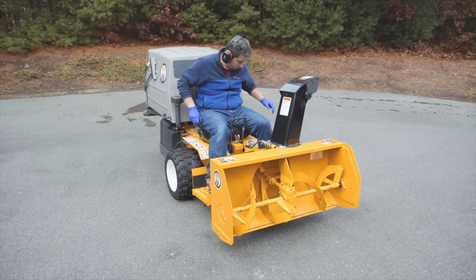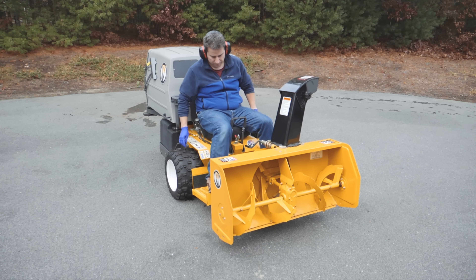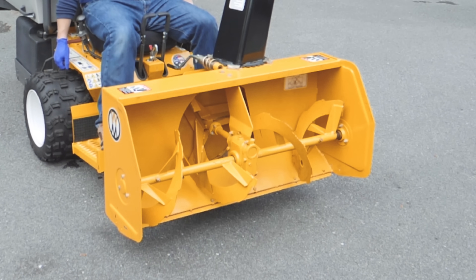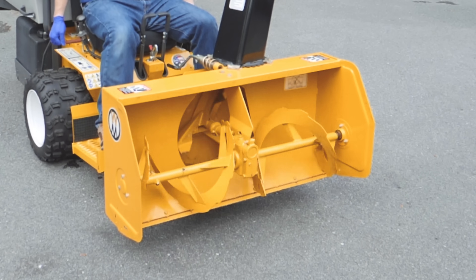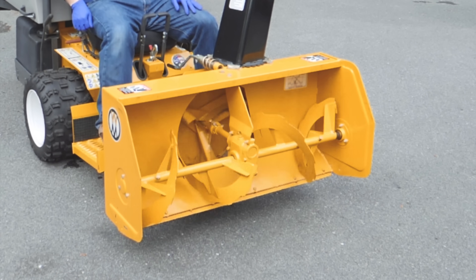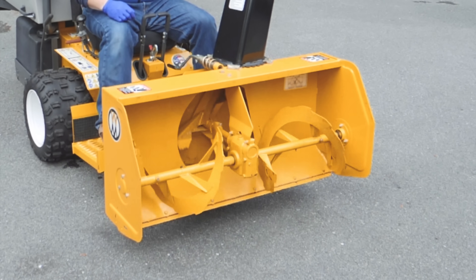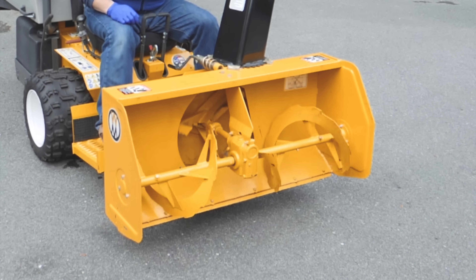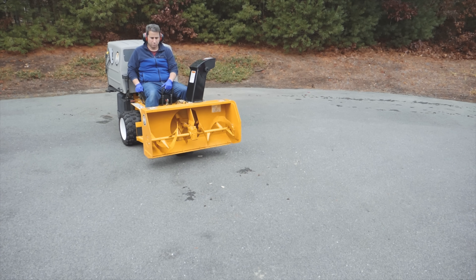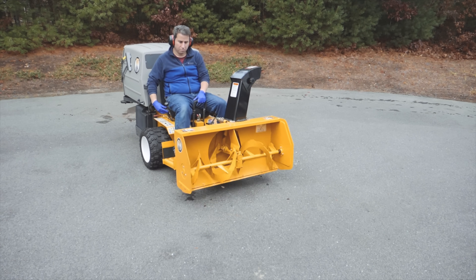Walkers are just like any other machine with an electric clutch — you really want to make sure that when you engage that clutch you lower the RPMs. That's how the Walker does it, by lifting that lever. Now I'm just going to rev up the throttle to put it to maximum speed. Walker recommends that running this snow blower you only run at maximum speed. That's really different than things like John Deere diesel tractors where you can really vary the speed. Walker 100% recommends just keep it at maximum power for best operating efficiency.